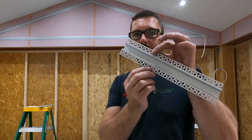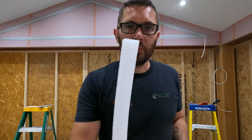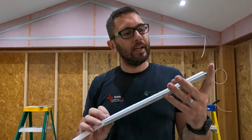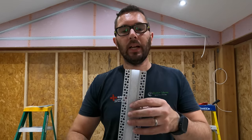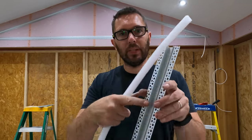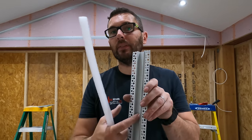Once you've cut that in, you use your plasterboard screws to fix it on up and down. Once you've done that and you've got your cable in, they actually supply you with foam. That foam is what you push into your profile, and with that being in there, you can plaster straight up to the edge of the profile. Just before it goes off completely — after your first coat and second coat — you pull that out and it leaves the inside of your track nice and clean, with no muck in there. That's going to be key because when you're putting your ribbon LED tape inside, we've gone for a high-end ribbon where the LED chips are a lot closer together, so it's seamless.